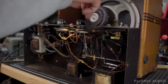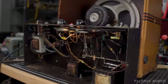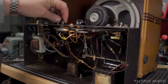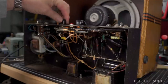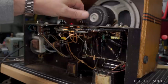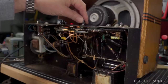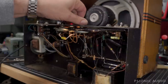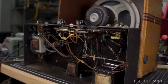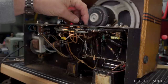I'm hearing a little bit of a scratch, and this is with the volumes off. Not hearing microphonics — that's good. Let's bring the microphone input up. A little bit of noise; I need to see if that's DC or just a dirty pot. The instrument volume is much quieter, at least as far as noise level goes. There's a little bit of noise when I turn it all the way down. We have normal tone and bass tone controls.